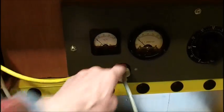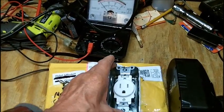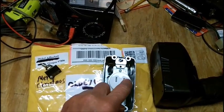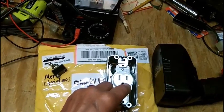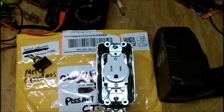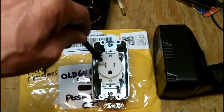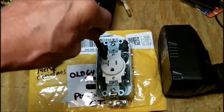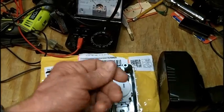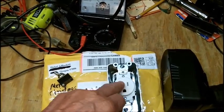One of them went in here, but I thought I had more and I didn't. So I had to go buy this. I bought this at Home Depot and it was about three and a half bucks, so that was a little better. All the outlets now have a child-resistant design, and it's a little tight getting a plug in here because they got baffles on here. The way it's made, you can't stick something in one side — it won't go in. You've got to do them both at the same time. So this is an outlet you can't really test with one of those electrical polarity checkers — you need one that'll push both sides at the same time.